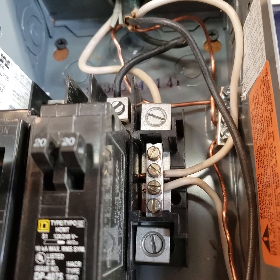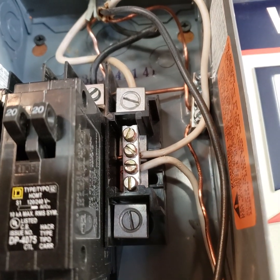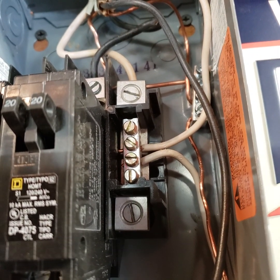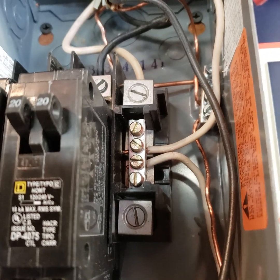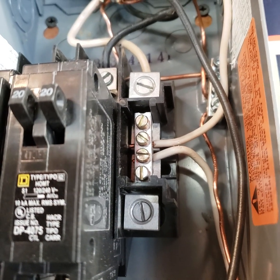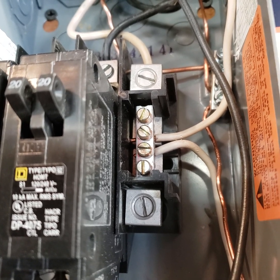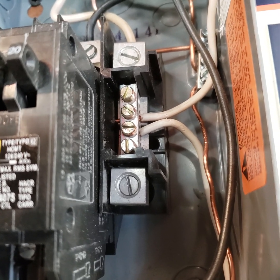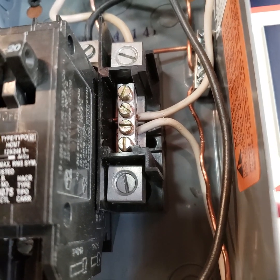In this case, you have a 10-amp motor with 10 amps coming in and 10 amps coming out on the neutral. The ground should never be live unless there is a ground fault — that's the only time it should be live. That's why on a sub-panel the ground and neutral are not bonded; the ground is bonded to the frame, and that's all it should be bonded to. The neutral is always separate from the ground, unlike the main panel.